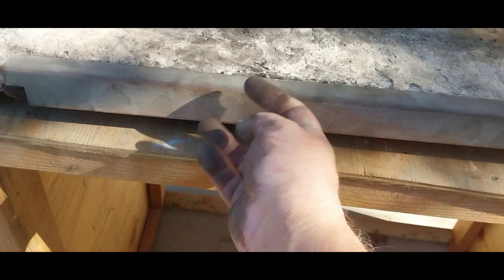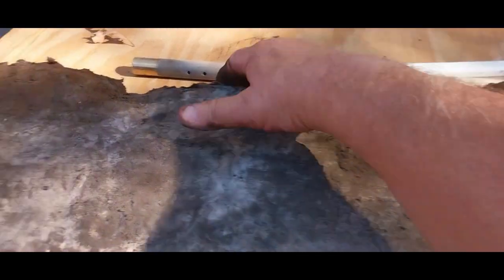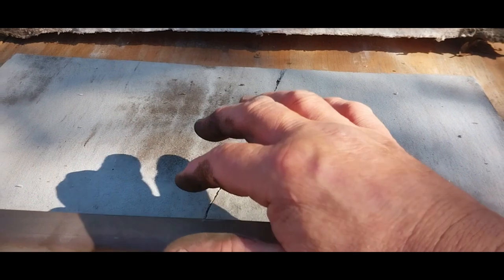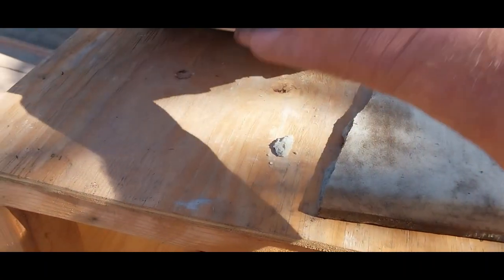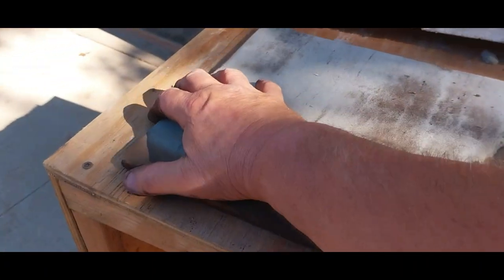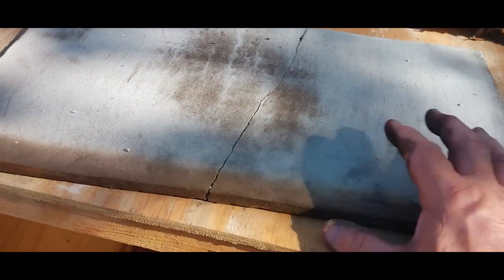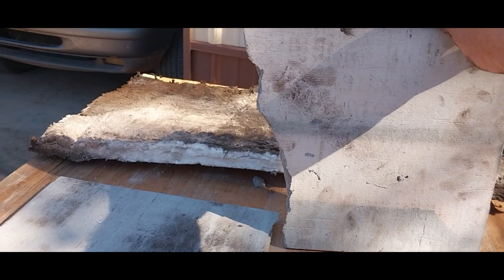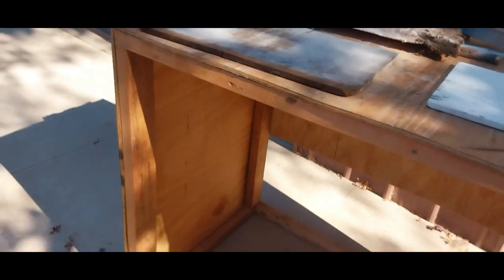Now this is what I found that was very dangerous — not knowing because I didn't see anything. I pulled the pad out and pulled it apart in my wheelbarrow — be gentle because this stuff is fragile. It's cracked. That is your fiberboard, and it just slides off. What gets me is why I didn't see any burn marks or heat damage come through here. We flip it over — you can see the side that faces the fire — no smoke, no damage, no cracks visible.